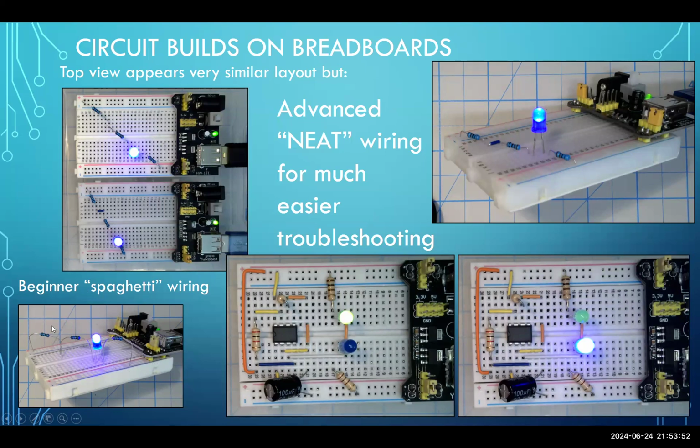The wiring goes all over the place. And so with these resistors, you would take them out of your kit, as I've shown you in a previous topic video, remove the masking tape schmutz off the ends of them, bend them slightly, and put them into an appropriate pattern that will provide continuity and electricity to flow from the positive rail all the way through to the negative rail. And the LED lights up, power supply is lit up.